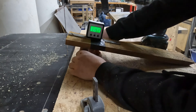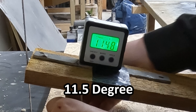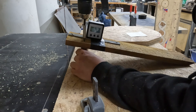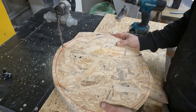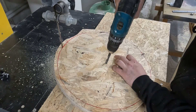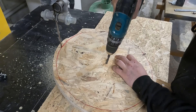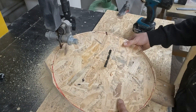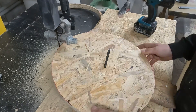Before we jump into the metalwork, let me walk you through the first step. To kick things off I needed a solid foundation for my cyclone, so I decided to build a wooden frame for the lower funnel and also a frame for the upper cylinder later in the video. This fixture allowed me to cut a precise circle from the board with an angle at the edge. I secured the jig with some clamps, then marked a circle on a wooden board and placed the board onto the jig, which had an 11.5 degree angle to the saw blade. Then I started cutting towards the edge of the marked circle. After the initial cut I drilled a hole in the center of the circle, which served as a pivot point preventing the board from slipping. With the drill through, the board was securely in place — now it was just a matter of rotating the board around the hole, allowing me to cut a perfect circle.